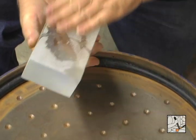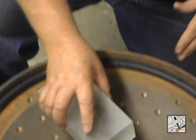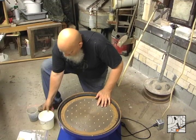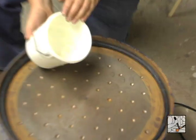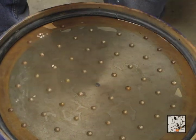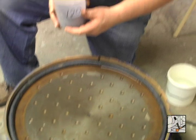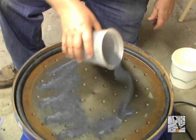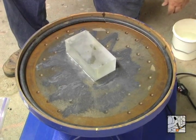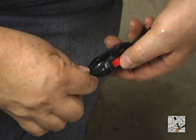I have a block of glass that has been rough ground just to knock off the high spots. This will go right on the pan with the grit. The only components for grinding here is enough water to cover the bottom — too much water will splash — and in this case I'm using 120 grit silicon carbide. The glass goes on there. There's a handy little switch on the cord. You're going to want to make sure that this doesn't get splashed on, so it stays dry.